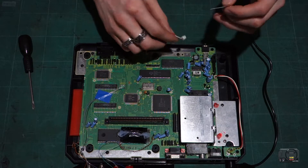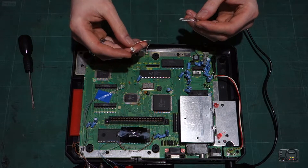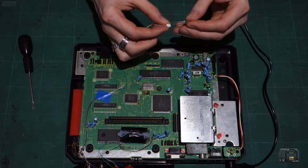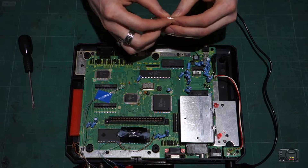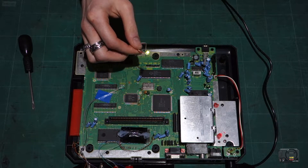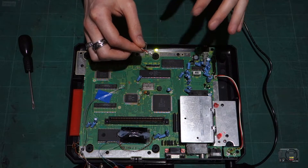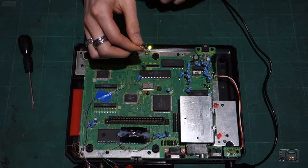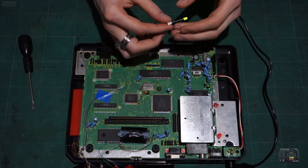Okay guys, I'm just going to quickly find out which color corresponds to which leg on the LED. I'm going to use the original terminal point for the old LED. White is your ground, so make sure white goes in on the center pin. Slide your LED into the connector, make sure it goes all the way through. Add some power - there we go, the shortest leg is green. So you know that the cable you want goes to whichever color you want for the switch position. In my case I want the stock seven megahertz position on my overclock mod to show a green LED, as it's like a safe mode almost. So I need to make sure the right wire goes to the right leg.